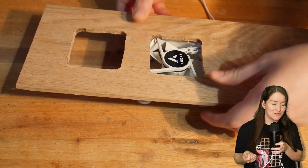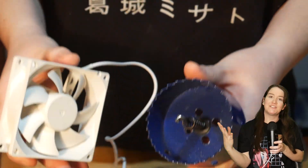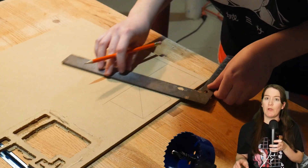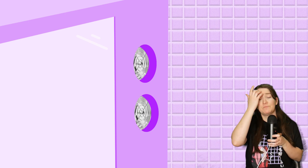Then I had a brain blast — the fan is a circle, so all I needed to do was get a three-inch hole saw to match the three-inch diameter of the fan. You might be wondering why I used quarter-inch MDF instead of just drilling the three-inch holes directly into the side of the cabinet. Well, one, I would have had to get longer mounting screws, and two, I thought it would look way better if the fans were behind this tiny quarter-inch of MDF as opposed to being hidden behind a full three-quarter-inch wall of the MDF cabinet.